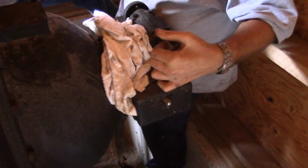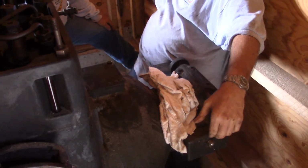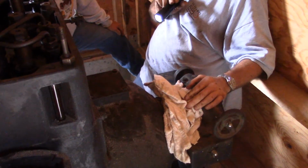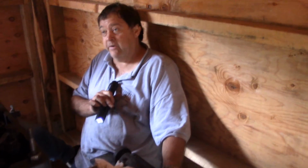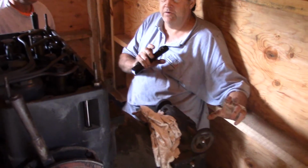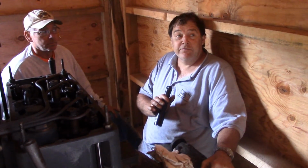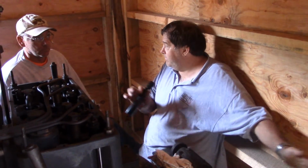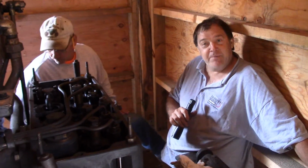So you've got a pretty fine adjustment, and then the electric motor went out here, the synchronizer motor, so that you could time it to the alternator and get the right voltage. Oh, that's pretty neat. I'm assuming it's working on voltage. Well, it's to get you the right RPM, so when you sync to the grid or sync to another generator, technically you don't want any load there. You can do it under certain conditions, depending on the setup, but this was designed to synchronize at no load. Then you bring it up to load. Then you could drop the other generator off, and anyone outside that building would not know you actually switched generators if you did your job correctly.